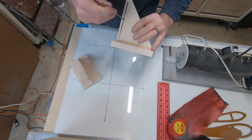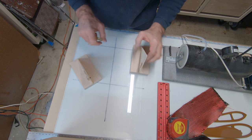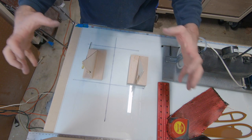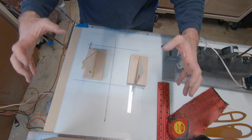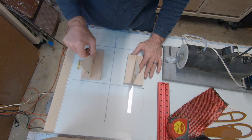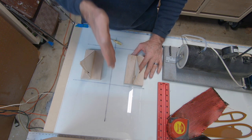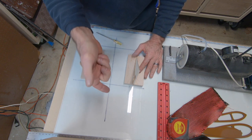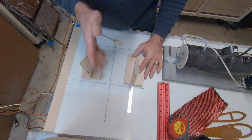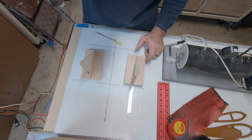And the neat thing is, once you get these things adjusted and locked down, these pins actually insert into your wing and stab, and it holds the whole airplane exactly where it needs to be. And then you'll go through there at the root of the stab and the wing, and you'll put fiberglass in there, or you'll actually glue everything together when it's in this state.